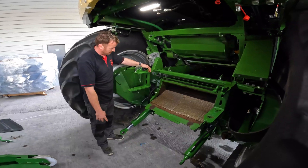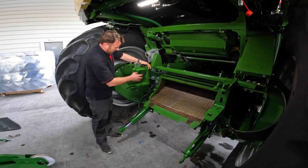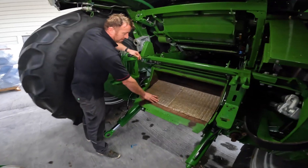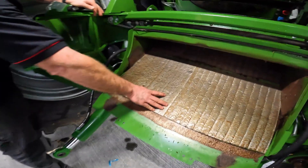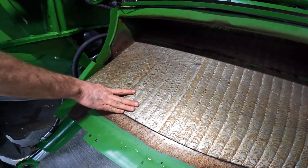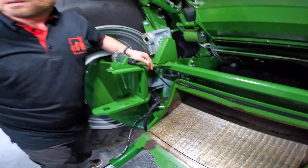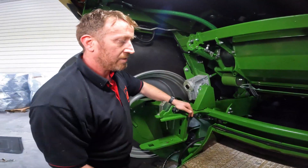Here is where the drum slides in — it slides in here and it's held in with two pins. This is something you won't see too often: the wear plates are exposed, and you can see they're actually coated in tungsten carbide. Tungsten carbide covers most of the heavy wearing parts on this machine, from the base plate all the way up to the top of the spout nearly.